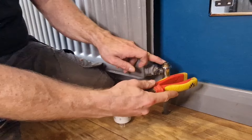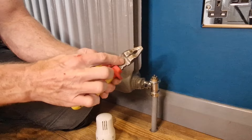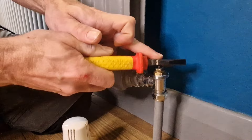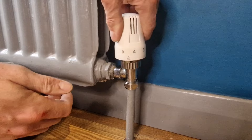Watch the pin on the top — you can sometimes see it rise. That is enough to free it out of that seat and allow the water to pass and free any debris. If that's not quite done it, get a flat edge like your pliers or grips and press on the top of the valve. Press the pin and you should be able to get it to move up and down. Once it's freely moving, you're free to put the head back on. Line it up with the nut on the top, tighten up the lock nut, and return it to the original position.